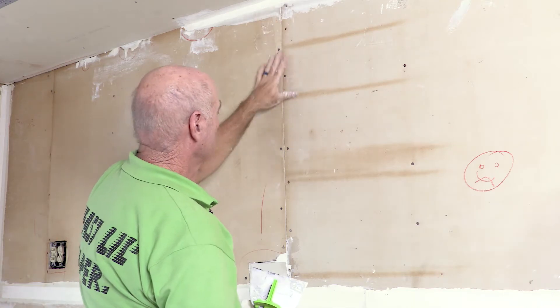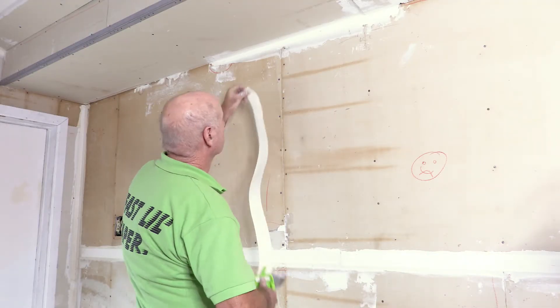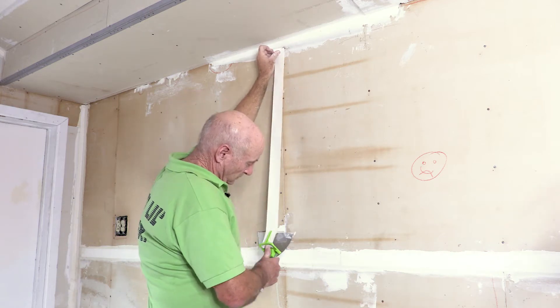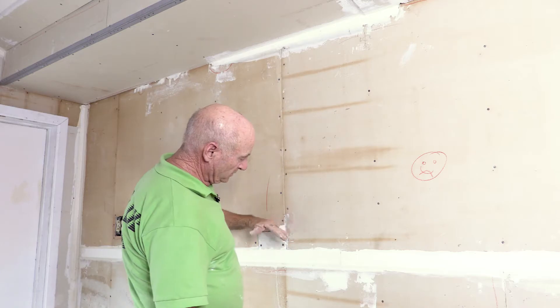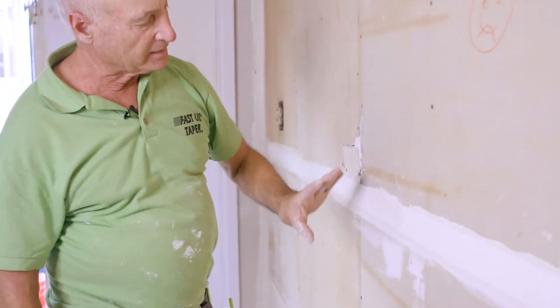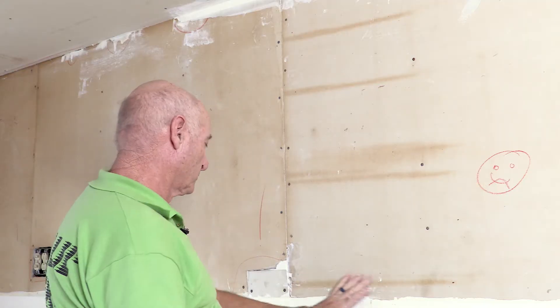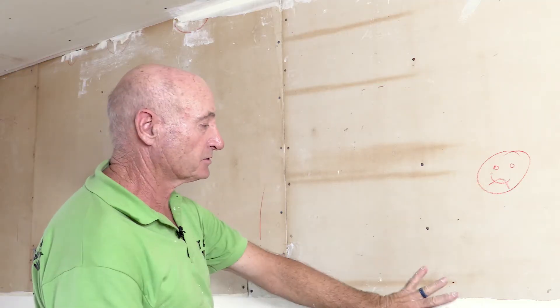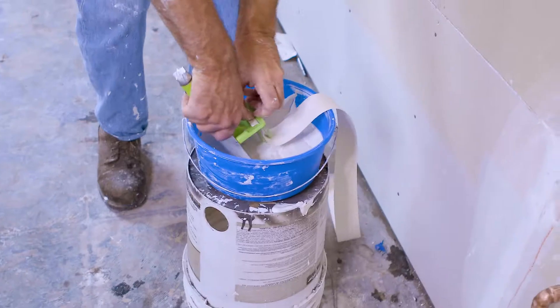On this butt joint — they work the same way as a lot of them do. I cut the tape to the distance between here and here. When you tape into a tapered joint like that, it's okay if the tape should overlap, because you've got three or four layers going back on top of this and it hides all that. So I'll go ahead and pull this through.